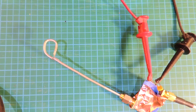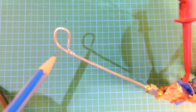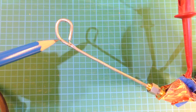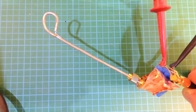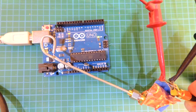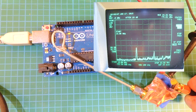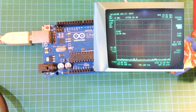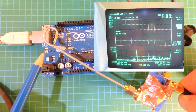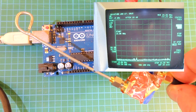Here's the near field probing operation. This is a piece of rigid coax — at the little end you can see it loops around with the shielding removed, leaving a small exposed wire. It's a very small pickup antenna essentially. If you try to probe a board — here's a classic Arduino — as the probe comes close to the board it senses the frequency, and as I move it away it vanishes. That's the concept of near field probing. You can look for emissions in a circuit board at a very small area. I think I've got myself a near field probe.